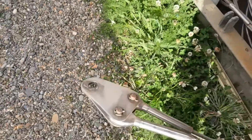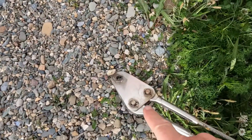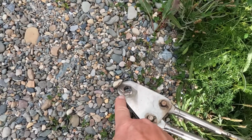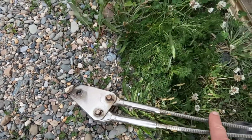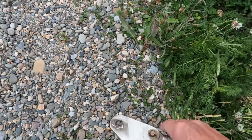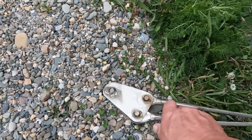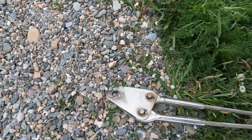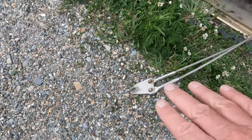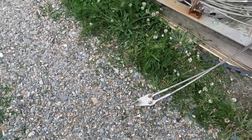This is from our old mast, our old rigging from the main mast. For our lower shrouds we have a hole here, a bolt goes through the mast, and then you have two stays via these two plates. There's no toggle to give articulation side to side, only fore and aft by being able to swivel through there. If you watch the latest Rigging Doctor video on building a new Dyneema forestay, where he talks about the importance of toggles, ours didn't have them — but what we've come up with is immensely simpler.